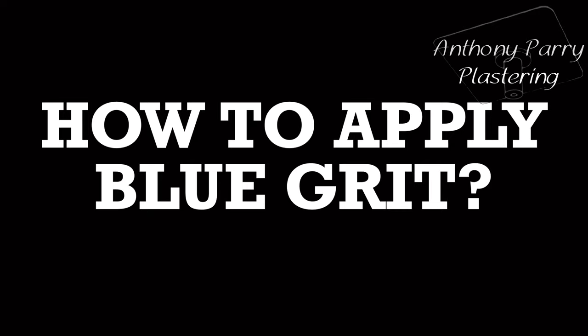When you're just PVAing and skimming, one of the things that you can find is that your PVA dries out a bit too quickly. So when it dries out and it's not tacky, basically it's not actually going to be sticking to the wall. So that's one of the main reasons why I like using blue grit. It's just that little bit of extra control.